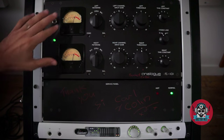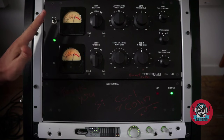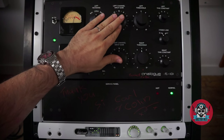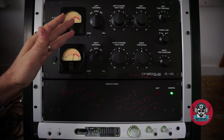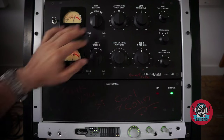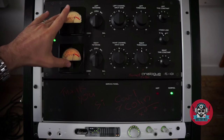The monitor section shows the condition of the limiting amplifier — that's how much gain reduction is being applied. Here's the input level. Now, like the original Fairchild design, this unit has a feedback circuit. So if you make a change at the input stage, the resulting output will be fed back. In other words, the more input you dial here, the more limiting you get at the gain reduction stage right here.